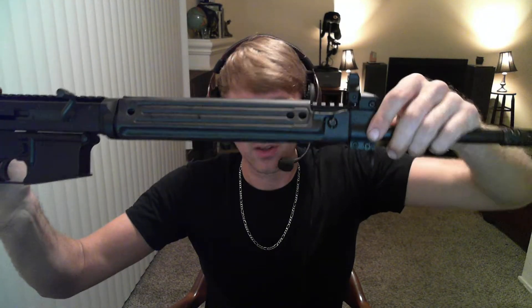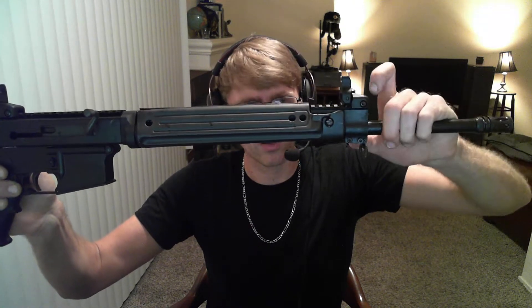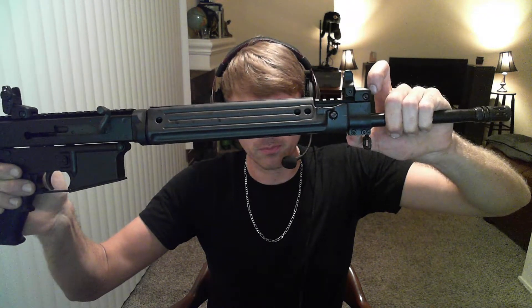My second trip back from the range, I went to the hardware store and put in three bolts. Because in Ian's video, this gas block is just pressure crimped to the barrel — not lock-crimped like where they'd mill out a section in the barrel where a bolt goes through. From what I understand, this gun — they did not do that. So I put in fresh hardware, Loctite, and torqued the heck out of those three screws. I never want to have issues with that moving.